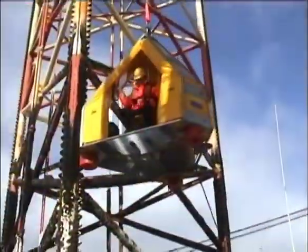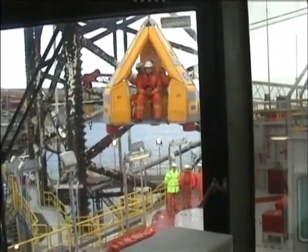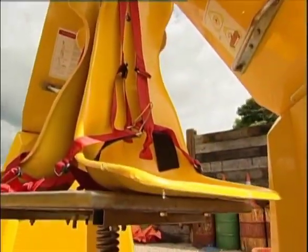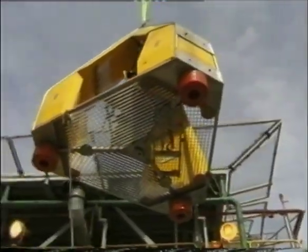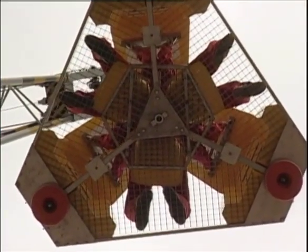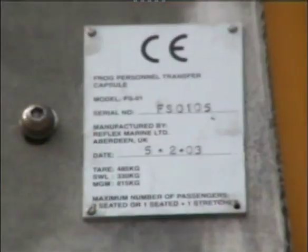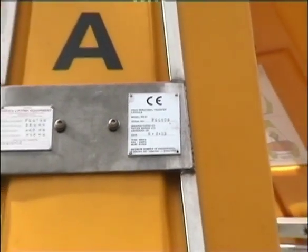Passengers are given protection from falls, whiplash, and lateral and vertical impacts by the use of bucket seats mounted on a fully sprung platform, which are fitted with four-point harnesses. The three landing feet also provide extra shock protection to the passengers and are of an anti-skid design. The tripod-style base helps when landing on a heaving vessel and uneven surfaces. The design of the FROG has been independently reviewed and approved by Bureau Veritas and the DNV.